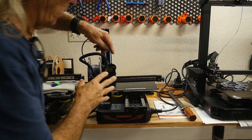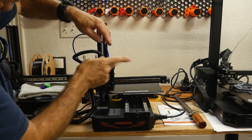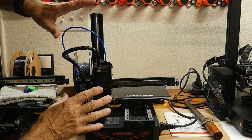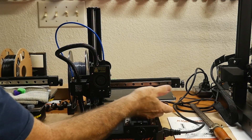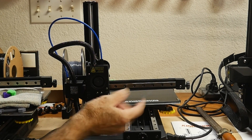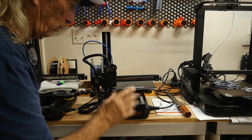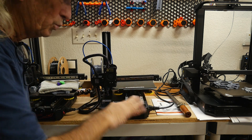To restart, same thing. Just bring your filament in, cut a 45-degree angle on the edge of the filament, then push it down through and set this tube back up in here, and you're good to go. The other thing I mentioned earlier this week on these was to put a nut or something under the springs here for spacers. It's a little tricky to do but not hard. I added quarter-20 nuts on all the springs under here — it stiffens the bed, raises the bed, and it'll help with your bed leveling. It'll also stiffen the bed so you don't lose your settings as easily.